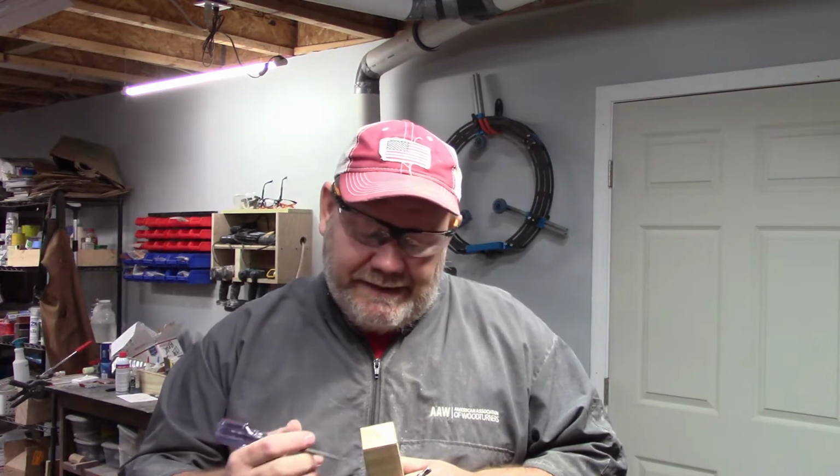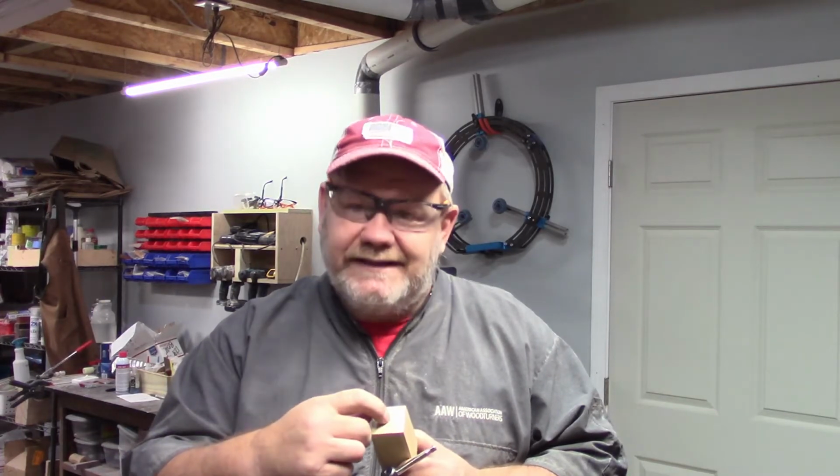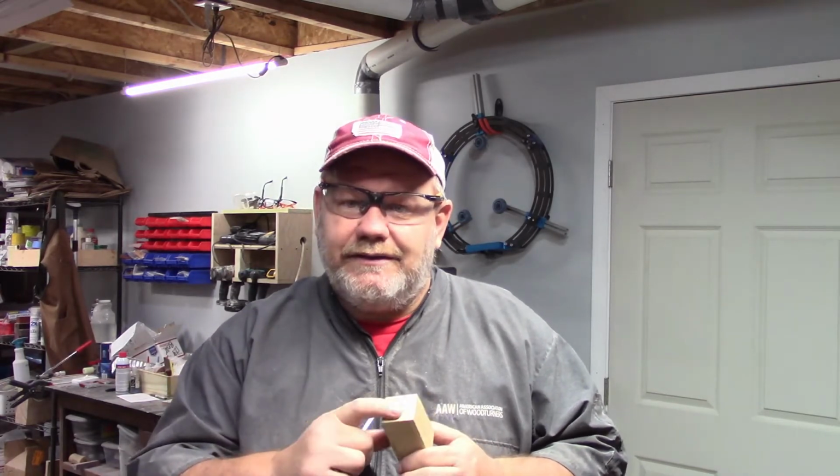We're here today to demo bottle stoppers, and today we're going to be doing a spalted pecan blank, but I'm going to talk about how to set up your blank. Basically, you find the center of your blank, and you take an awl and dimple the end of it. That way your drill bit will find that center and go in 3/4 of an inch, and you take a tap and thread your blank.